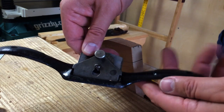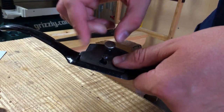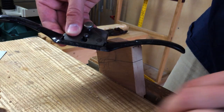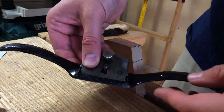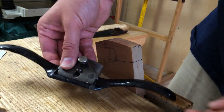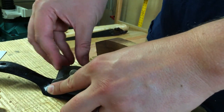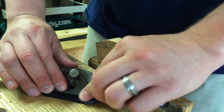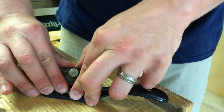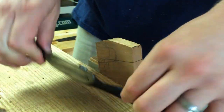Now when I want to reduce the cut I can't whack it to bring it back out. So I do have to loosen it up — and I suppose this is where the screw mechanisms could be really useful to allow you to back it out. Frankly I don't find myself needing to retract the cut in the heat of the moment very much. Even when I do, I'll loosen the whole thing out, pull the blade out, press it flat down on the bench, press my blade in so that it is now flat on the bench, and tighten it up.